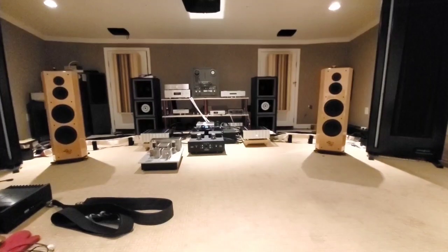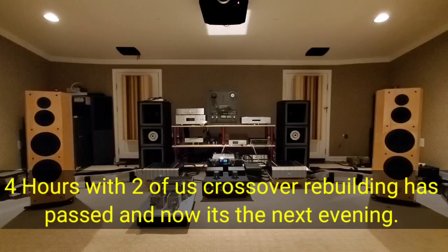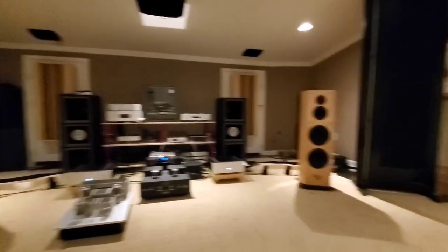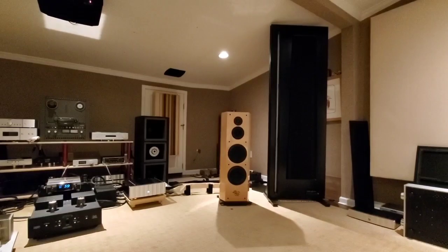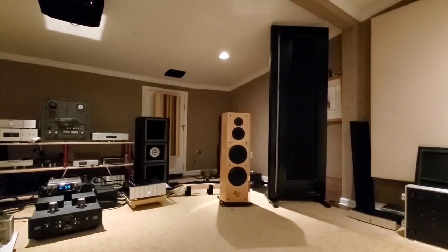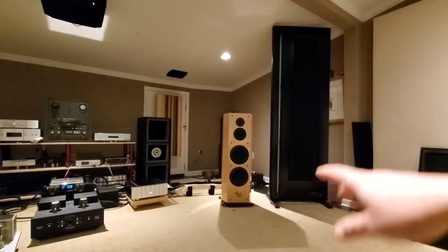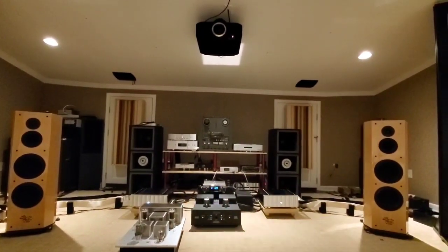I'm back, and it has been nearly 24 hours. John and I were up almost all night redoing the crossovers. They're set now at 12dB per octave, a Bessel filter at 680 Hz, for the Analysis speakers - two-way speakers. That ribbon tweeter goes very low, down to 680 Hz in this case, and then the woofer also acts as a subwoofer, going very low. We don't need to add any subs.